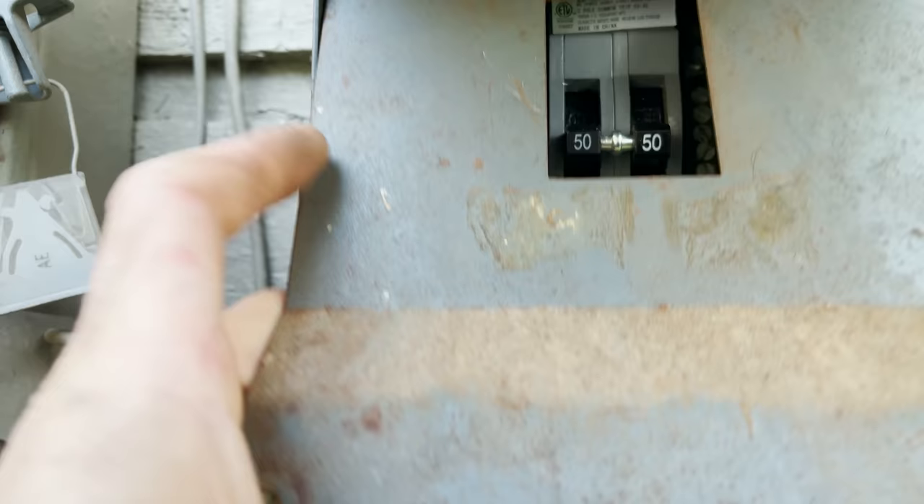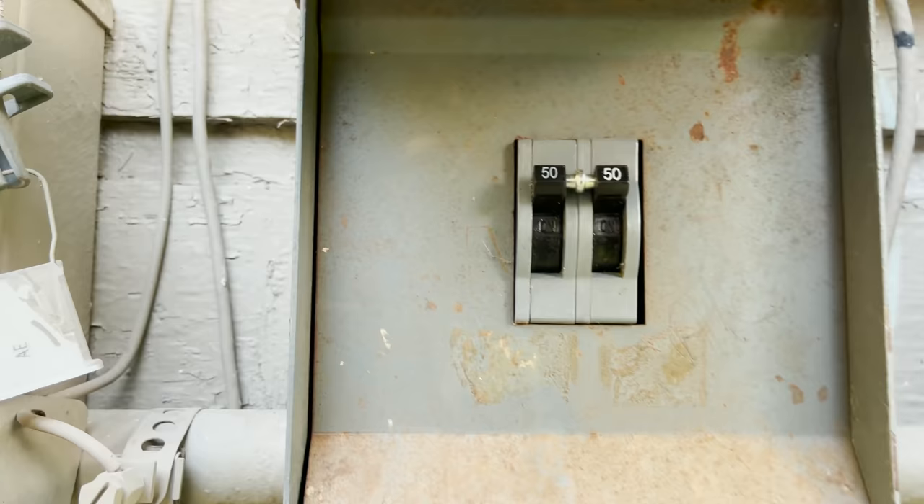I put the new breaker in — very easy. Just ripped the other one out, put the new one in. Nothing else about the system changed; I'd already handled all the terminations. I knew I had checked everything from this main forward through the system. She was saying it was everything in the house shutting off — not just a couple circuits or lights — it was the entire house. So I knew it was something at the service, not at a sub-panel or a plug or a switch. I felt pretty confident, but I did tell her there's a slight possibility this isn't the problem either, and we might be losing a phase through the meter. So let's monitor it another two weeks.